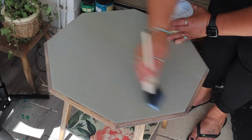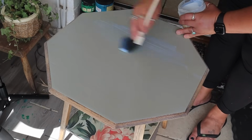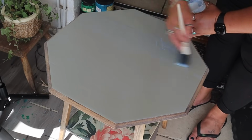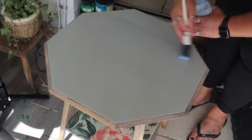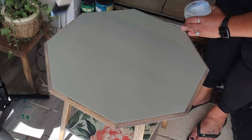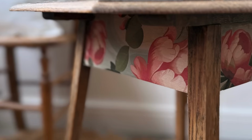So these foam and dandy brushes, it's actually a foam pad attached to a kind of paintbrush handle, and because there's no bristles, you get a very smooth, streak-free finish on your top coats. Highly recommend these brushes for top coating. It saves me a lot of stress and streakiness.